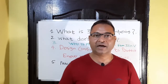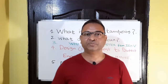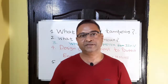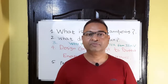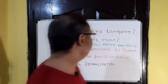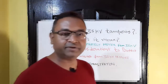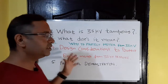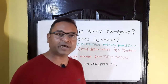Apart from that, in the hardware, some ESD semiconductor devices are used, placed between the line and neutral and at other locations, to protect the meter from such high voltages. So here I have covered what 35 kV tampering is, what it means, why it is required to protect the meter, and the core design considerations to protect the electronic energy meter from this much high voltage.